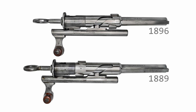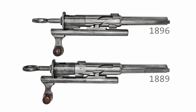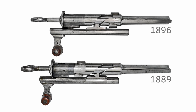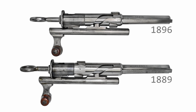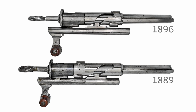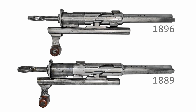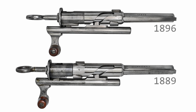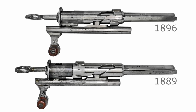They were stronger, more rigid, reduced instances of cracking, could handle cartridges in excess of 2,600 atmospheres. The receiver could be lightened by 100 grams. The actions were smoother due to lower surface areas in play, and the action length could be reduced some 2 centimeters, which was transferred into the stock length of pull, allowing for better posture when shooting. The test rifles used almost entirely off-the-shelf 1889 parts, except they did require the receiver and much of the bolt components to be newly made.